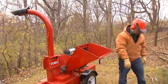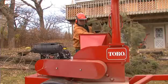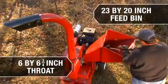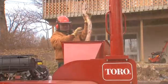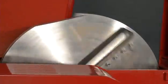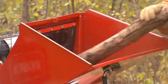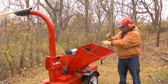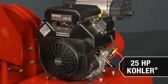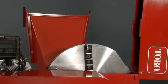Toro's brush chipper is ready to go. With just a 35-inch width, the chipper can be transported through standard 36-inch gates to get into areas where the branches are. It features a 6-by-6-three-quarter-inch throat and a 23-by-20-inch feed bin so you can easily feed branches up to 6 inches in diameter. The high-speed rotation of the blades creates a fine mulch, ideal for garden beds or mulch walkways. A heavy-duty centrifugal clutch gracefully handles sudden contact with large branches in the throat, making quick work of any size brush. And the 25-horsepower V-twin Kohler engine pushes plenty of power to the cutting blades on the 155-pound flywheel.